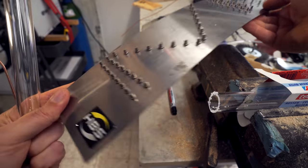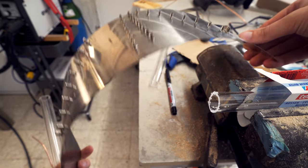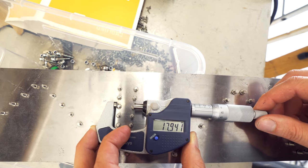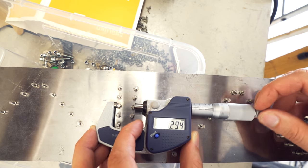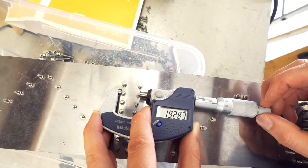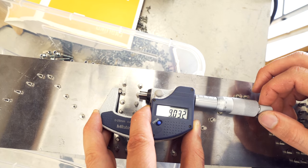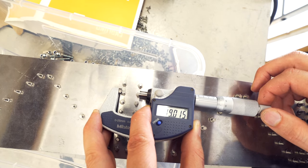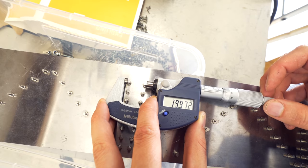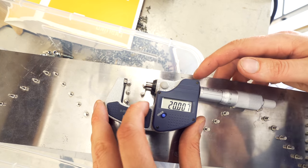I sent some requirements and they sent me this test piece, and I just want to show you how extremely precise this is. Here I'm using a micrometer which is measuring in millimeters. When you hear the first click of the clutch of the micrometer that's when you should read your value: 18.002. I'm actually measuring quite crooked so if I had a place to measure more straight we would get even better results. 19.015. This machine is down to thousandths of a millimeter in precision — it's just so promising. 20.008.